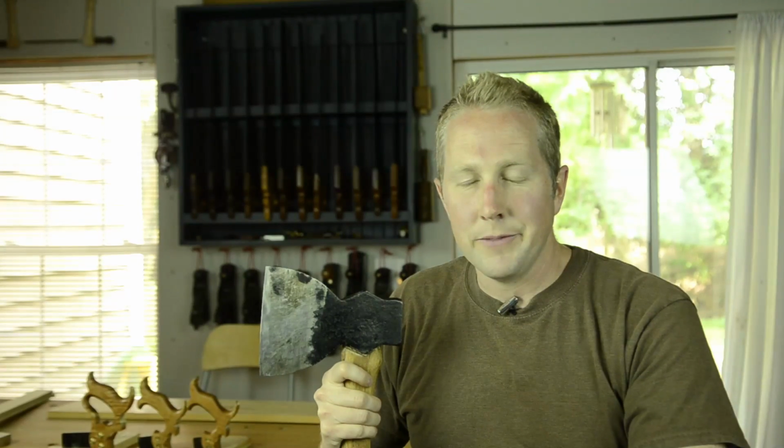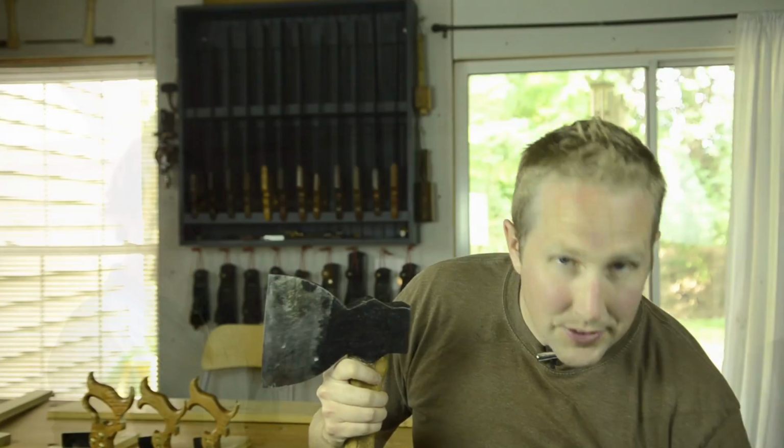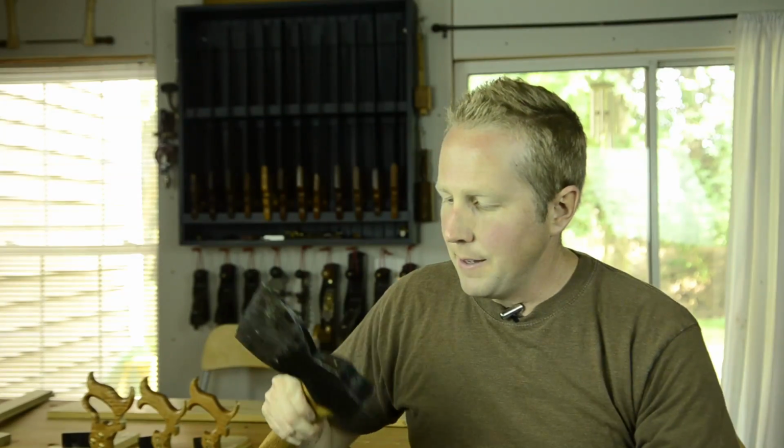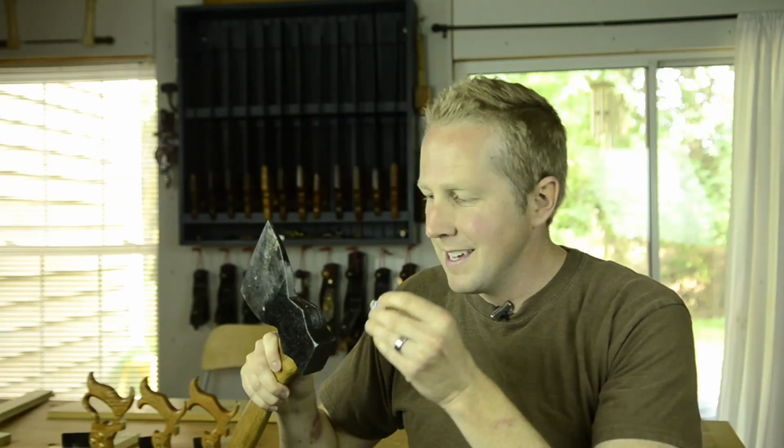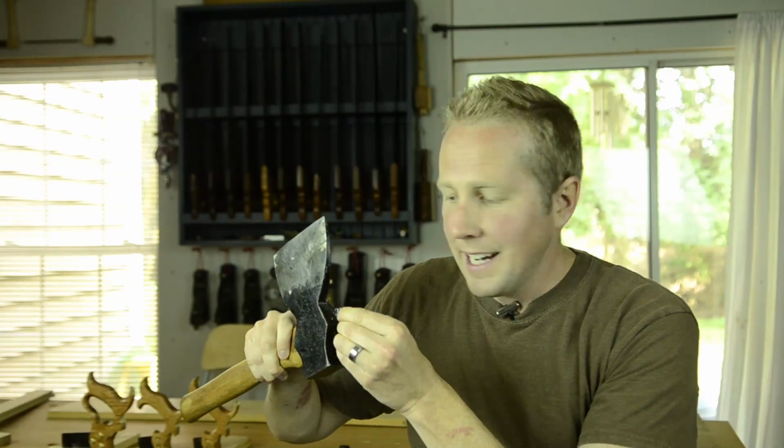And I tried everything. I talked to a lot of people and couldn't figure out a solution until I talked to the master, Roy Underhill. I was down filming a video in his school, the Woodwright School, and I put this problem before him. He looked at it and diagnosed it for me, and he said, even though there's already a wooden wedge in there, go get a little metal wedge like this and create a secondary wedge.